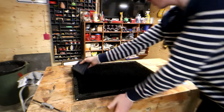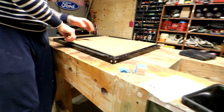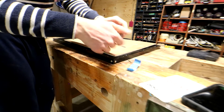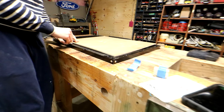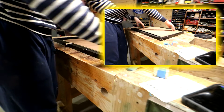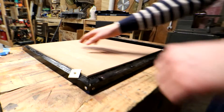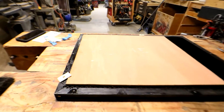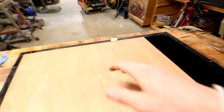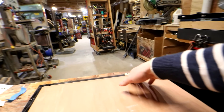There we go. I've got three holes on the end and four holes on the sides. I'm just going to use this board as an example because it's the same material we use in the laser. These screw holes are for the screws we found earlier to hold down these toggles. We've got another clip here showing just how wonky the board we're trying to hold down is. By just holding it down here and here, I was able to get the whole board flat enough that the laser can run across and not get any closer at any specific spot, within reason.